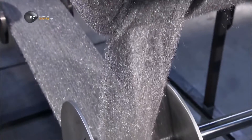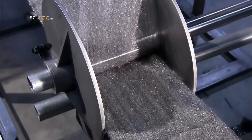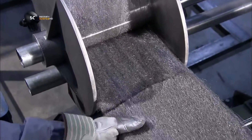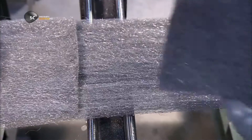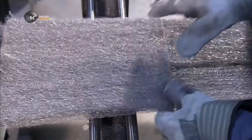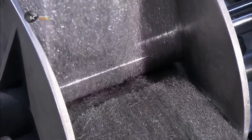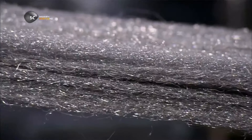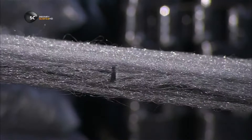To make household cleaning pads, they bulk up the steel wool even more. They insert layers of needle mat into the streams of steel fibres, giving it extra strength suitable for big cleaning jobs. The double-layered stream then heads over to the needle punch machine to be woven together.